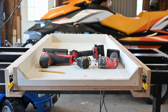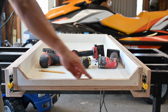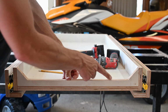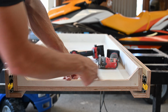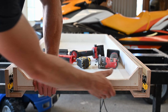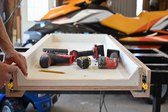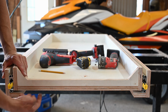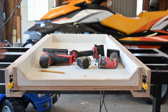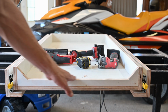There we go. Now I just got done cutting that, and this would make a lot more sense to have a solid piece of wood here, not plywood, because you got all this open end grain and there's some voids here, which is pretty common with cheaper plywood like this, even though it's not really cheap anymore. But anyway, I'm not gonna glue this. I'm just gonna put a couple screws in it from the bottom and maybe 2 from the side, because I'll probably eventually end up having to replace that just from it getting beat up.